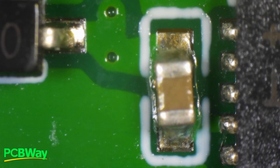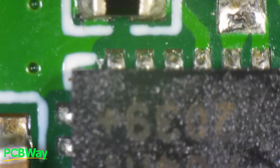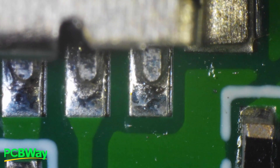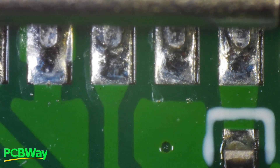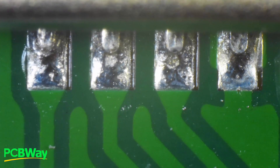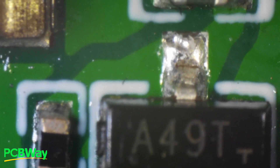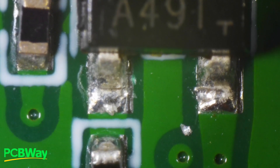As a bonus, we can see some of the solder joints of the smaller discrete components. Now let's look at some of the bigger solder joints — these are the pads of the microSD card socket. There is consistency there. Although consistency is less critical here since these are bigger pads, you can see one pad that doesn't have that smooth surface, but it's not a big deal — these are large pads, there will be more than enough contact. Also looking at the smaller components for shininess and making sure there is no excess solder — they all should work.